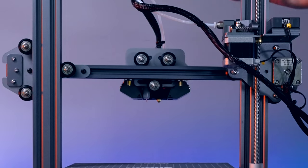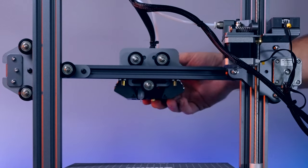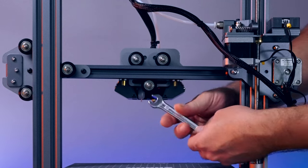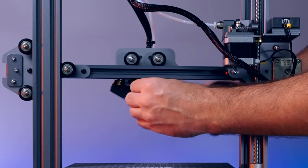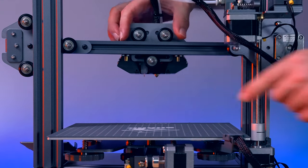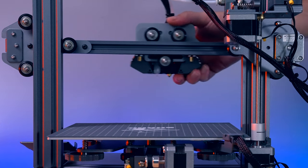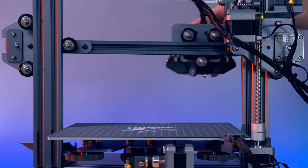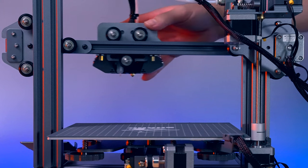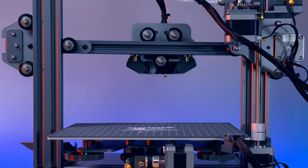While we're back here, we can go ahead and do the rollers on the hot end — and you can see this thing is completely loose. On this one, the top rollers are stationary and the one on the bottom is adjustable. We're going to grab a wrench and simply turn it until it grabs. You want the same result as before: friction on the rail, no wobbling, really solid and smooth. Check the smoothness all the way through with no jumping or anything weird. Check your belts too — make sure they're lining up. Everything looks good on mine.